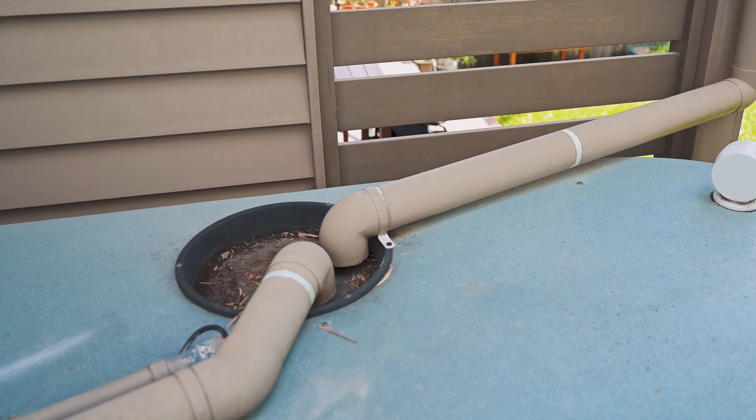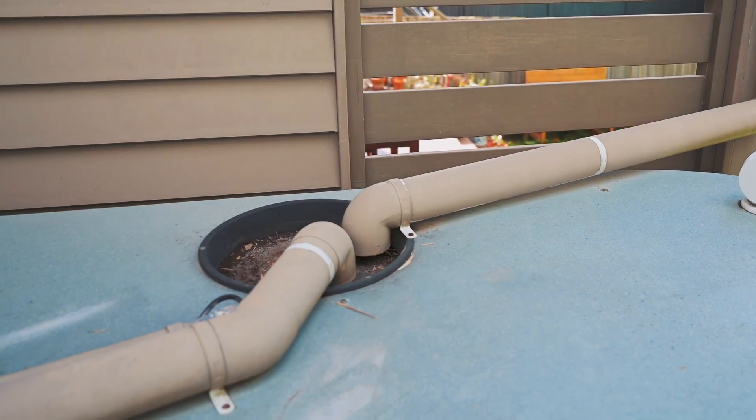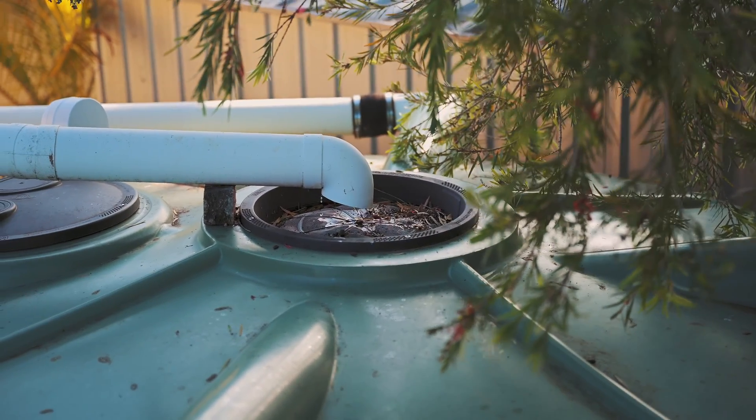As an alternative to putting a rain head on your downpipe, you might choose to only filter leaves at your tank. Perhaps there isn't much head height between your gutters and your tank top, making installing a rain head tricky. If this is the case, putting a tank screen or some other sort of tank-top filter will help prevent leaves from entering your tank. Keep in mind this arrangement is better suited to dry systems where it's less likely for leaves to be sitting in the pipes, because left unchecked, leaves and debris can be the root cause of a few collection issues.